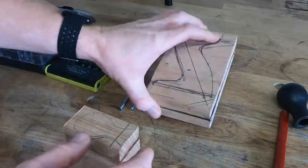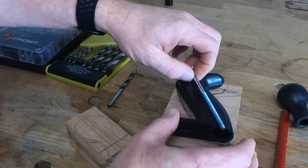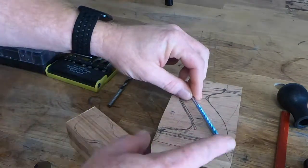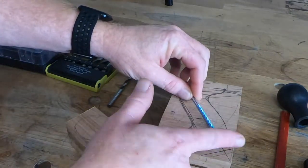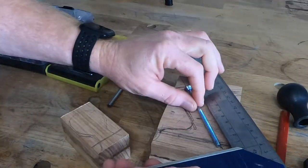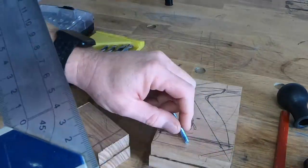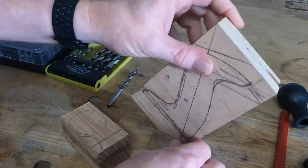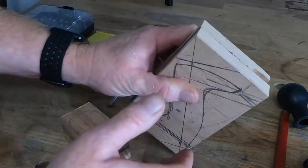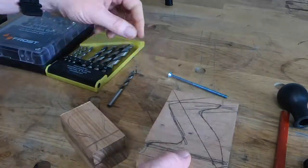Okay, so we removed the clamps. I've given a quick drawing of this and again set up the hole angle to drill this perpendicular, 90 degrees to this. Take a square. That is this line here. Basically, cut that off, set this on the drill press. Also cut that. This will be flat and we'll be able to drill straight on the drill press.